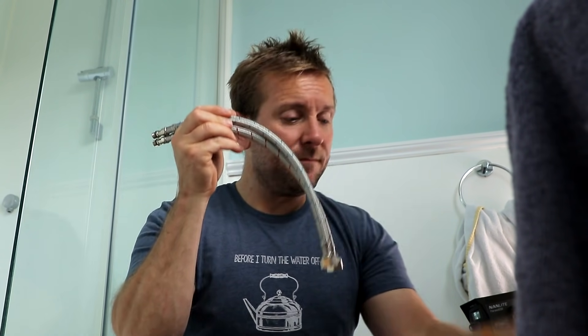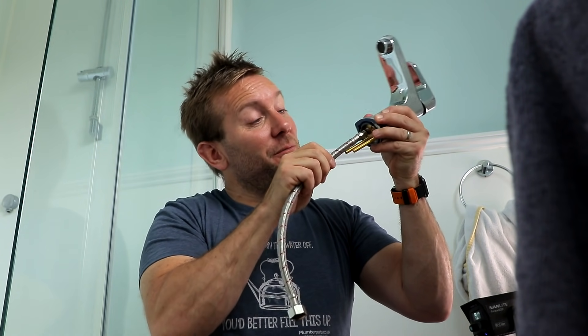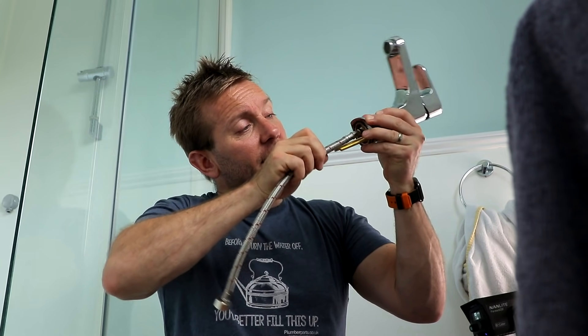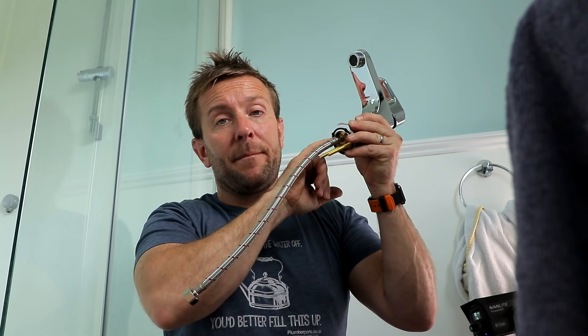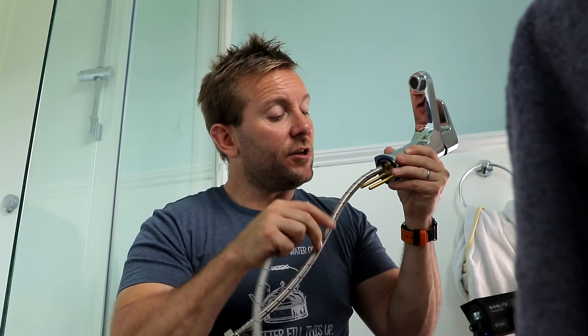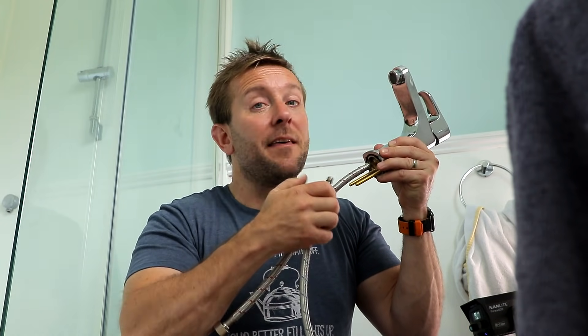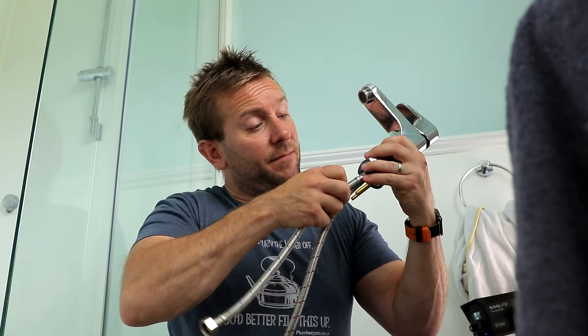The braided hoses on these are colored - we've got a red one and a blue one. Red is always on the left. Sometimes it's not, but it should be for water regs in the UK. You may ask why - it's actually quite a good reason. It's for people who are visually impaired. Now these, you will not need to do up too much. They seal up on a small O-ring just in here, and that's where the seal happens. The seal doesn't happen because of tightness, so just give them a little nip up with your hands and then they're done. So I'm just gonna get this other one on here, and then we'll be ready to whip this tap back in.